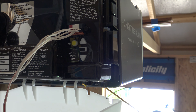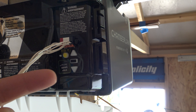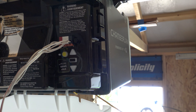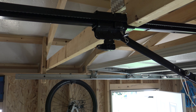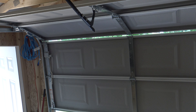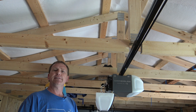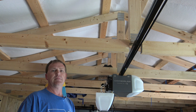Now that everything is set correctly and it's done its automatic cycle, if you just want to test it out all you have to do is hit one of the buttons. Whether your door is open or closed is going to make a difference — mine's closed so I'm just going to hit the up arrow one time and it's going to come all the way up to the limit switch I set. If you want to manually close it, hit the down button and it's going to go right down to the limit switch I just set. That's all there is to setting your upper and lower limit switch. The directions are a little bit fuzzy but hopefully this video helps you out. Thanks for watching.